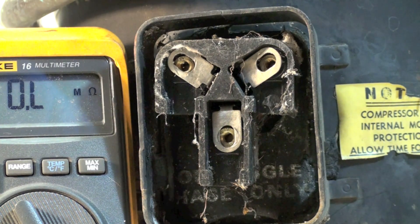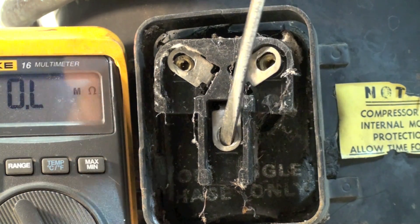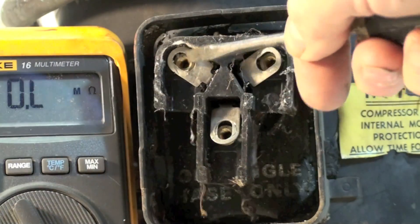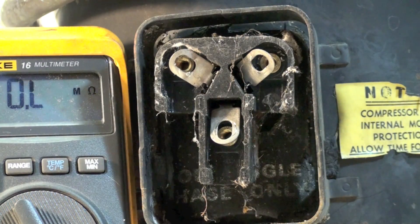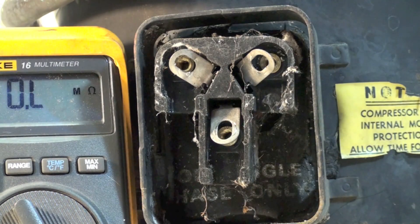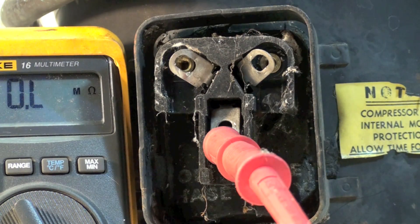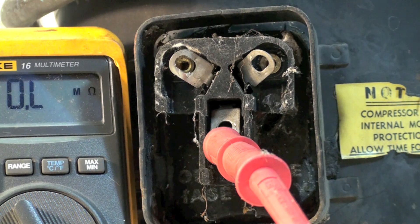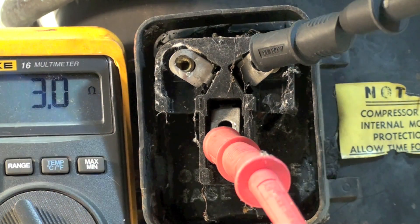The thing I'm most worried about when doing this is to make sure I get accurate numbers. To get accurate numbers, you can't have anything between you and what you're testing. You don't do it on the wires or on screws that held wires — you have to get the terminals bare. I usually use clips like this because they hold a little better and get better contact, because contact is everything with an ohmmeter.